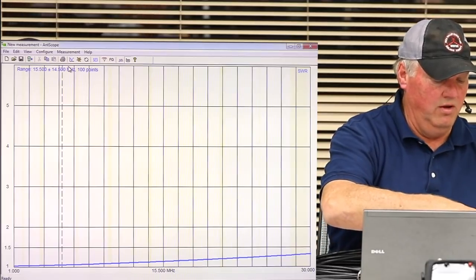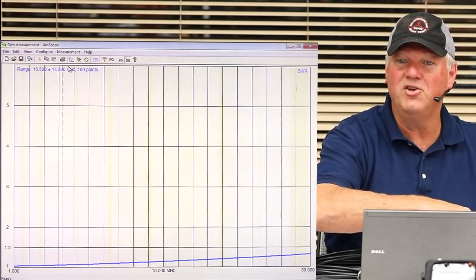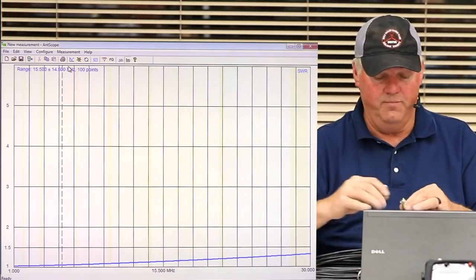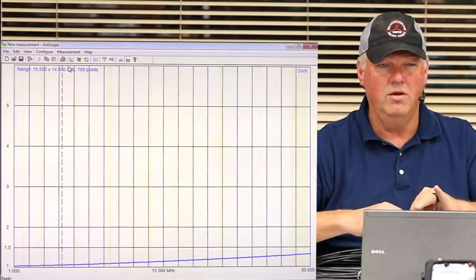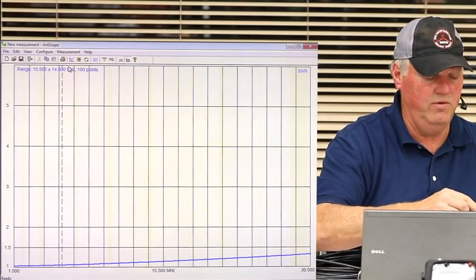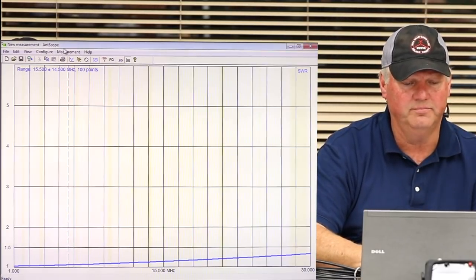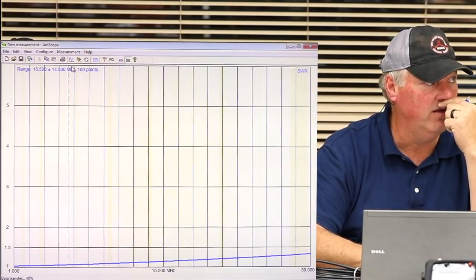So now I've built my perfect antenna with my almost perfect matching device. And I've ordered 50 feet of coax from the internet because it's so convenient. And I'm going to hook it up. Now we're going to pretend that this is my antenna system, and I stuck it out there on my pole, and I'm going to talk to everybody. But before I do that, we got our MFJ or our RigExpert or our Comet, and we're going to check it because we're good hams. What does my system look like? Anybody have any idea what it's going to look like?